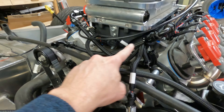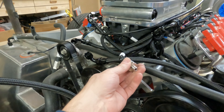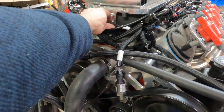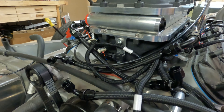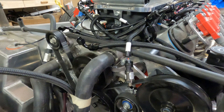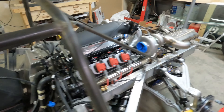There's some more wiring coming around to a few sensors. This is the fuel pressure — I've got to get a fitting that plumbs this into the fuel pressure regulator. There's the MAP sensor and the manifold air temperature sensor, which will screw into this location here and the connector will plug onto the back of it. These three all run to the fuel regulator. Just waiting on that ECU to come in so we can continue wiring, but we were lucky to find one and the wiring is coming along nicely.